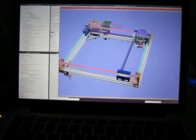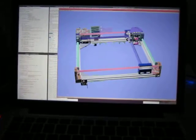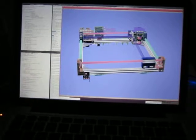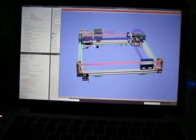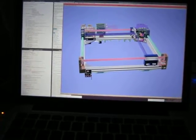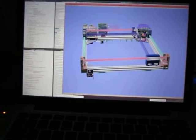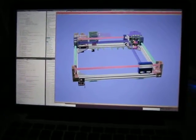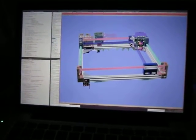With the Volcano and the Flex 3 drive, I've already done tests of up to, I think, about 90 cubic millimeters a second of extrusion through that, and it's been fine. That was at 400 millimeters a second. It's just that the arrangement with the belts was just not good enough, so I had to go.